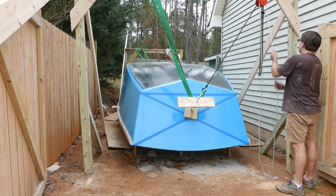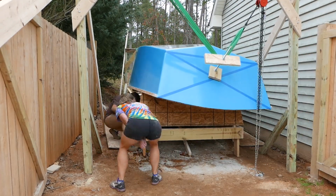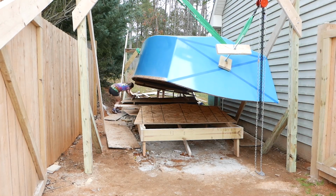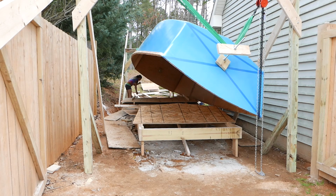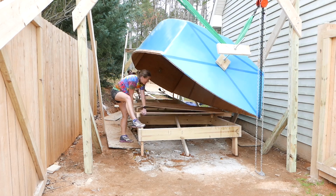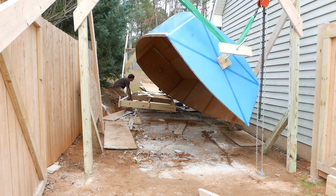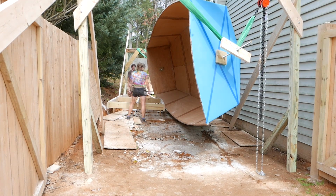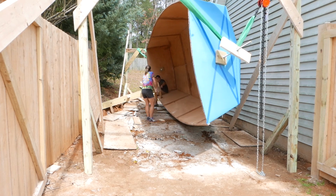After detaching most of the forms from under the boat, we wrapped a heavy-duty lifting strap under the all thread rod at each end and began to raise the hull using the chain hoists. Around 90 degrees, the hull was ready to come around and high enough to clear the ground, but it was pinched against the last piece of our building cradle. We decided the safest solution was to stand clear to either side of the cradle and lift it into the hull. This worked out well, as the weight of the remaining cradle frame slowed the rotation of the hull to a manageable speed.